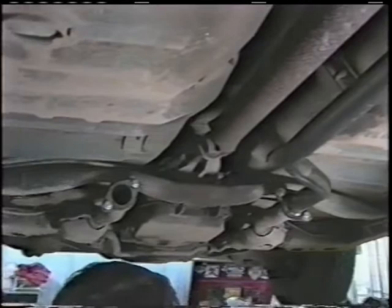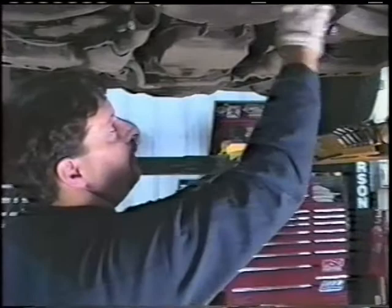Coming back underneath the car, I've finished this end. You see how I've angle cut each side and made them the same, because I made this pipe come straight into this one. You'll now see how nice it fits. It'll butt up to your other pipe and it leaves no gap. That way it's an easy wire weld. I'll go ahead and mark that with a magic marker just so that you can sight what I can see under here and what I'm going to cut out.